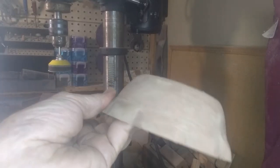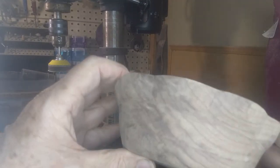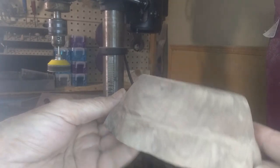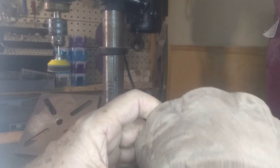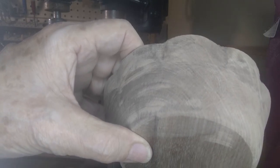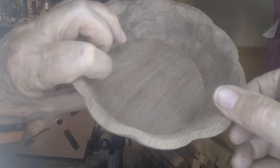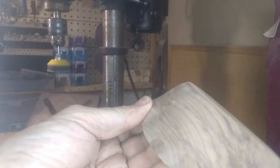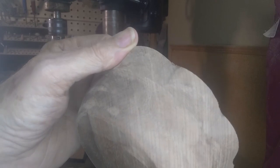Here's the preliminary rough sanding and shaping. It's not going to look exactly like her bowl, but I kind of like the way this top is fluting out. That's all with 60 grit — I'm going to move up to 120 and go over it again for more shaping and cleaning, and then probably another grit after that. Once I get it where I like it, I'm going to go inside with the inflatable ball sander and thin this wall out all the way around to give it a little fluted edge. I like to put my own spin on these.